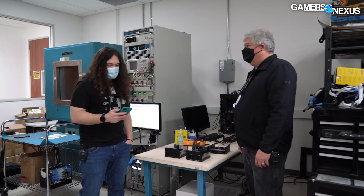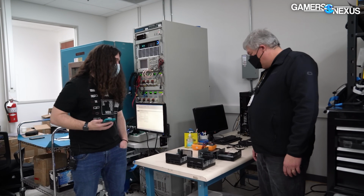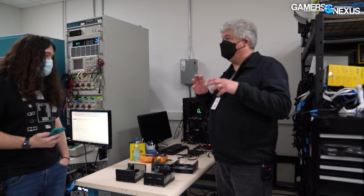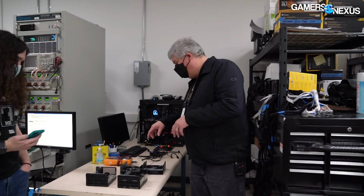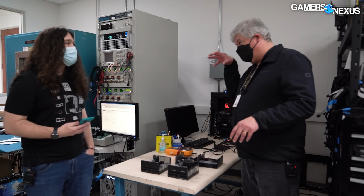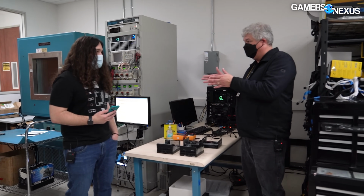And you were also talking about pressure for fans. Yeah. Especially relating to heat sinks, I guess. Well, we use the term static pressure, but it's more static pressure than what you would use for a radiator because it is more obstructive, right? So when you have something like the RMX here that has the maglev fan, you'll notice the blade shape is a little different than the one you would use in your case, because it is cramming more air in a straight line, as opposed to a conical pattern. And the more static pressure you have, of course, the less conical it is.